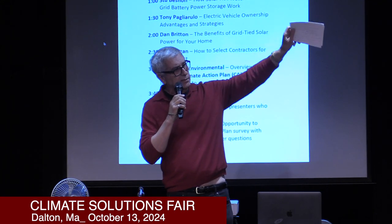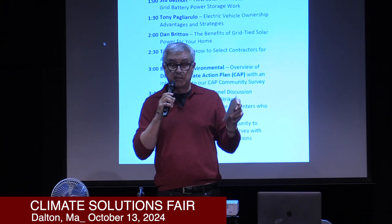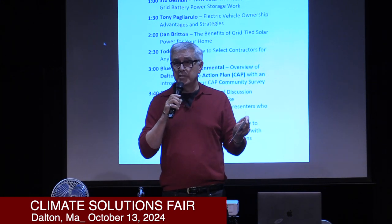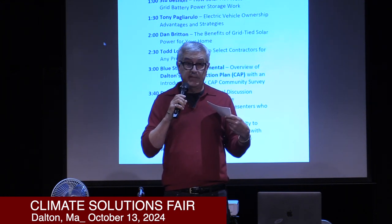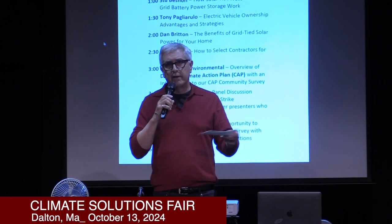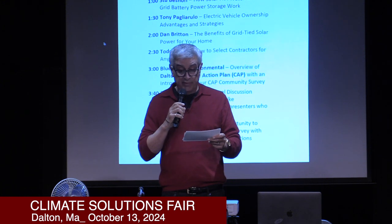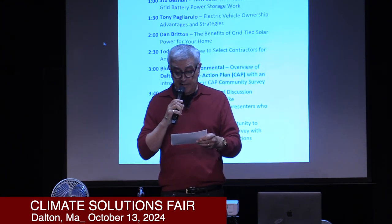In kilowatts, the ones behind the CRA will be at 19.2 kilowatts — just under 20. The one here may be 6.6 or 7.2 kilowatts. Mine is about 7.6 to 9.2 at home with a 50-amp. The larger the breaker, the larger the wire, the more amperage — so we'll be charging at a faster rate behind the CRA. Most aren't up to that speed.